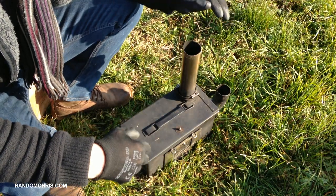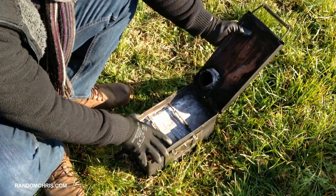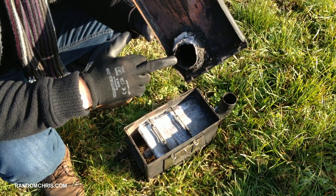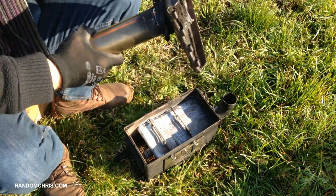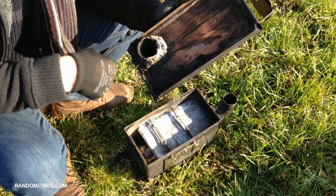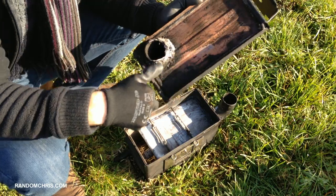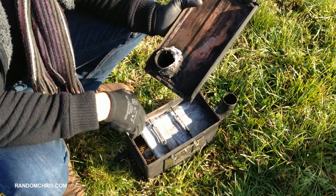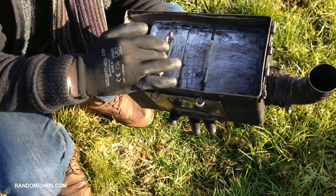If we open it up, you can see the inside. There you have the stove rope wrapped around and the jubilee clips — it's really solid and doesn't move. The first thing you want to do is remove the rubber seal that sits around the top of your ammo can. Just stick a screwdriver in, pull it out, and replace it with stove rope. The stove rope gets compressed when you close the stove with the closing mechanism, so you won't get any smoke escaping from around there.